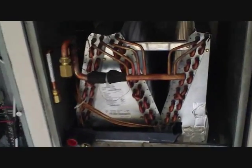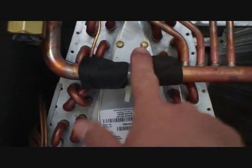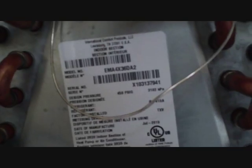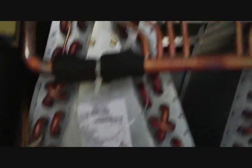We have our indoor section. Bolt-on line set, brazed-in TXV already brazed in, tube already mounted. We've got our 3-ton evaporator coil — well, evaporator slash condenser coil since it's a heat pump. There's our little N coil.